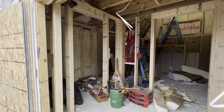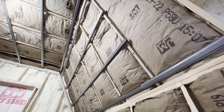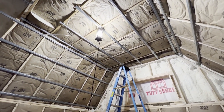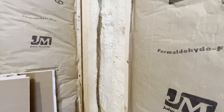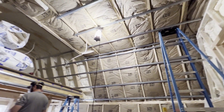Once the putty pads are in place, you can start installing the insulation. I always recommend using the cheapest insulation that offers the right amount of climate control. Because of the spray foam, Henry probably didn't have to worry as much about climate control, so the insulation is primarily being used for soundproofing purposes — to create a mass-spring-mass system, which is what the double wall system is. Insulation is installed on all the walls and ceiling.